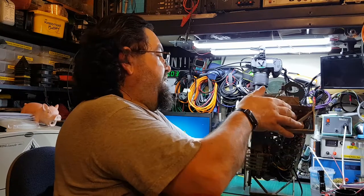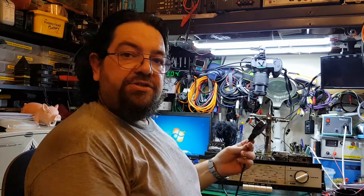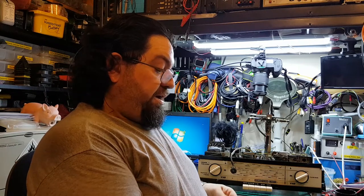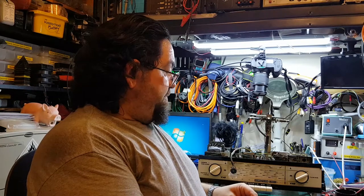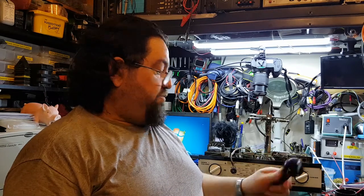What I have done is cleaned up the front panel so it looks a lot better, and I've also replaced the mains lead with a UK style plug with a fuse in it that is removable. It's only a two-pin plug because the chassis isn't earthed — the original chassis is not earthed — and when it's in its case it's in a wooden box, so there's no way you can touch anything live. It doesn't actually need to be a three-wire system.